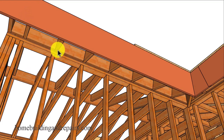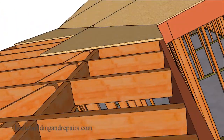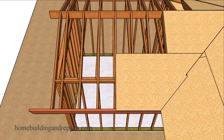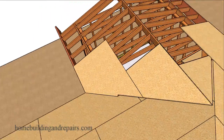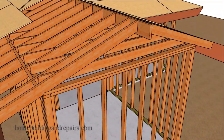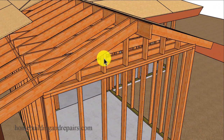A view of the rafter blocks from the bottom, and then from above. The ceiling joist and rafters will usually connect to the wall framing plates with 16D nails — some will need to be angled, while others will be driven straight through the ceiling joist into the side of the roof rafter. In this video, we are going to install straps over the sheathing instead of collar ties as a replacement. Of course, you will also need to install some gable studs — whether or not they line up exactly with the studs below, I will leave that up to you.